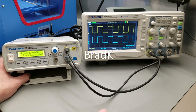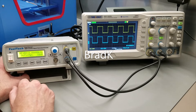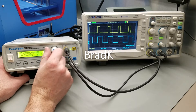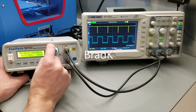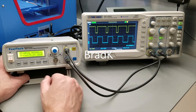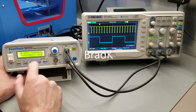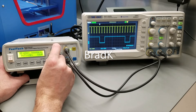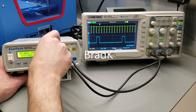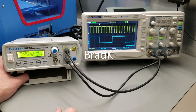Going back to channel 1, the duty cycle is adjustable on both channels from 1% all the way to 99%. You can see I can go all the way down to 1% if I want, and all the way up to 99%. Say I'm operating at 83% duty cycle on the resonant frequency. My gate frequency, we'll set that to 1kHz. And if we want a higher duty cycle on that as well, I can adjust that without affecting the other channel. So it's really easily adjustable. With this, all you need is a circuit to combine the two signals and then the VIC coil primary driver.